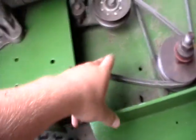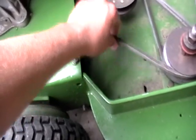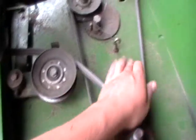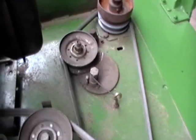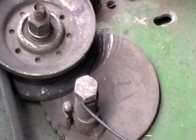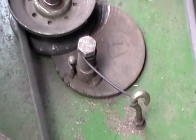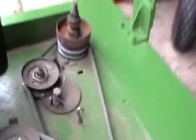But it can engage the blade, and it's pretty loose, so I'll have to tighten up that belt. And this belt here, it's not too loose. But another problem I'm having is that pulley right there — it's supposed to be an auto-tensioning thing, but it's broken. You can see where the pulley was rubbing on it before; it's rubbing on it again. You can hear it. So that might be slowing it down, so I gotta readjust those.